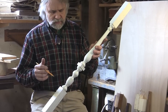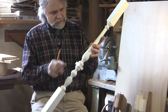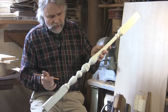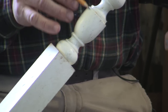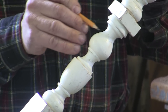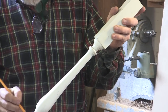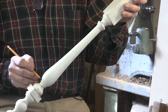And once again it has rhythm, repetition, and variation. In this case, you see we have three squares: we have the base, a small square, and then the big square on top. And then we also have three urns — this urn, a second urn, and then the final urn. But they have the same basic elements. The bottom urn here has a classical column base with a bead, a land, a cove, another land, and an urn. And then the upper one has a similar thing — a more abstracted column base, a more dramatic and curvy urn, but still very classical. It has the mushroom cap. And then the top urn has a very similar base down here: the bead, the land, the cove, another land.